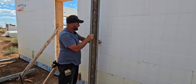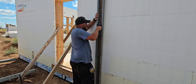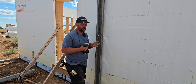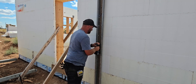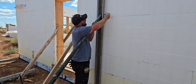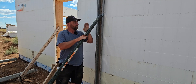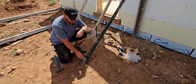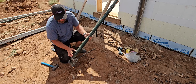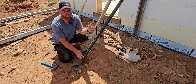I'm going to line these slots up with the plastic stud that goes all the way to the top and screw this through the slot through the wall. This pin goes through this hole up here. You can see this diagonal going down — that's the foot of the brace, and this diagonal piece is used for adjustment of the wall. You want to start by backing this out quite a ways; these have a really long adjustment range.